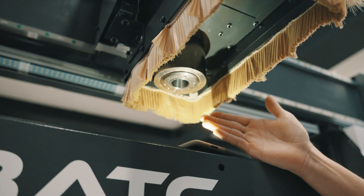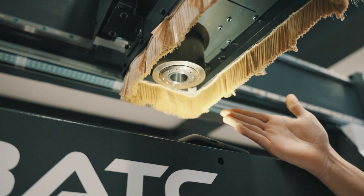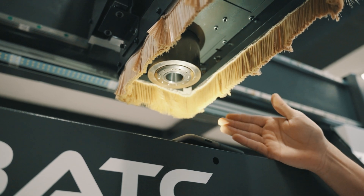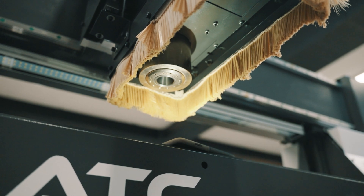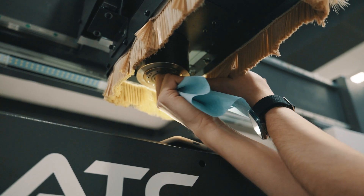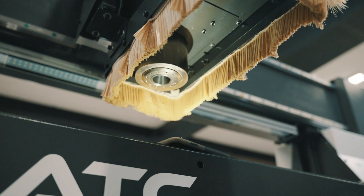Here it's good to ensure that the taper is clean. It is a perfect mating surface between the tool holders and the taper, and if it's not perfect and there's dirt or debris built up in there you're going to have precision issues. To clean it, take a soft cloth and simply wipe the entire taper. Before doing this, make sure that your machine is turned off.